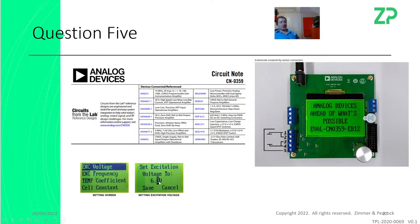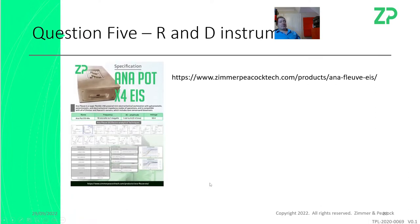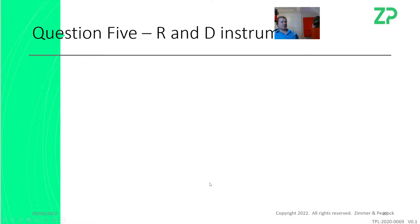And what they're correctly doing is playing with their settings, because what this board is expecting is a very traditional conductivity probe. But these guys are using something that's very functional, but in some ways non-traditional. And so you do have to change these settings until you've tuned or calibrated it so that you get 12 millisiemens as well.